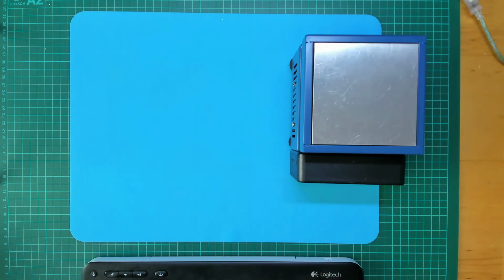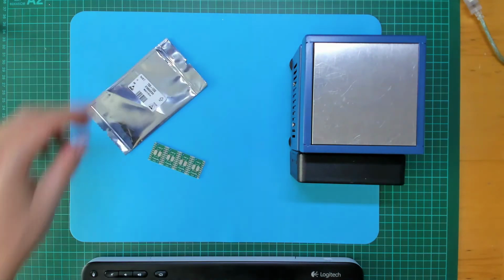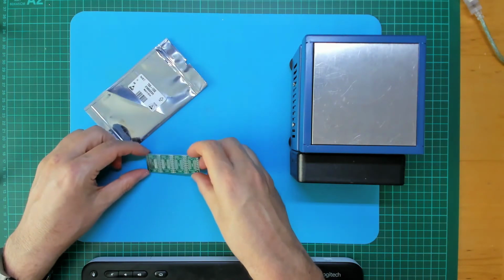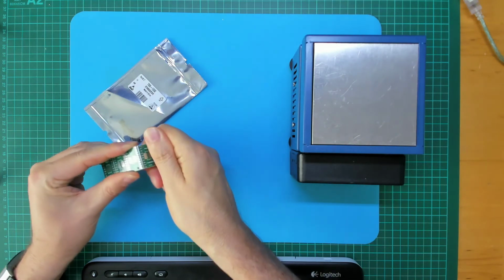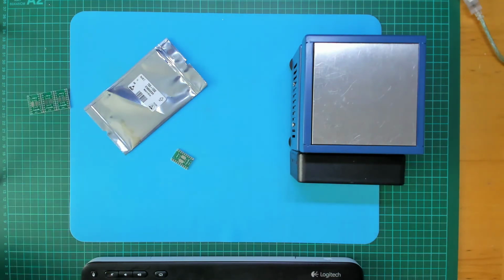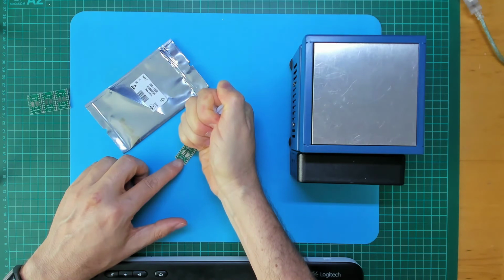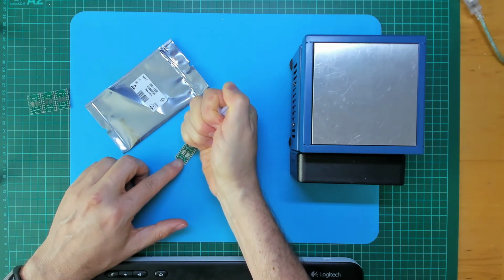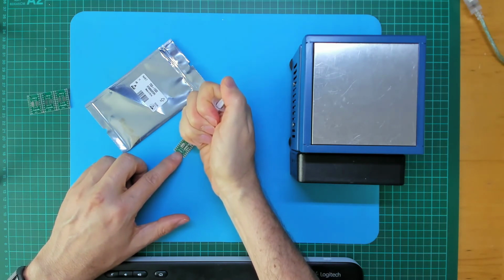I'm actually doing a project with some STM8 microcontrollers, so I just need a breadboard, one of those. So I thought I'll grab one of these little 20-pin dip adapters, and get myself some solder paste. I could just manually solder this, but since we want to give the preheater a shot, let's use some solder paste and reflow it.